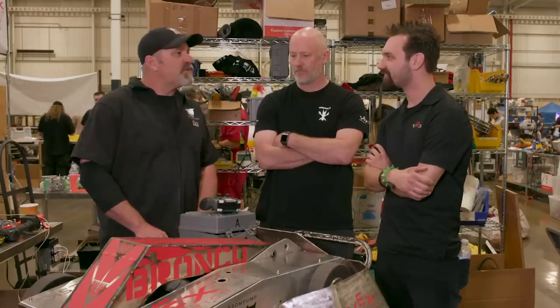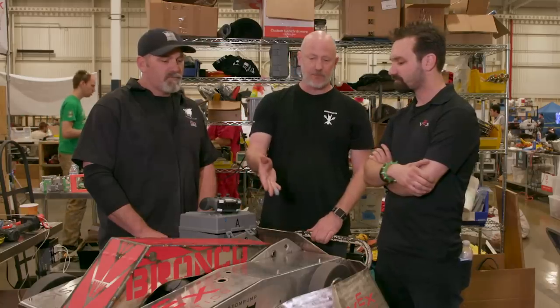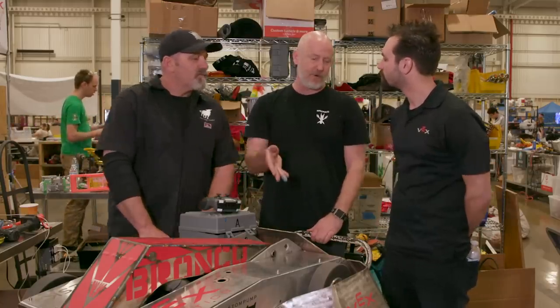There's a lot of really complicated valving and sequencing, and all the controller programming for the mixing curves. It allows us to have an incredible amount of functionality and choices we can make for how the robot drives and how it all works. We can plug a laptop in, watch how Reason's controlling it, change those curves, and actually reprogram it over the air. The design cycles of 'did that work?' become instantaneous. The speed controllers are also by Vex and they allow programmability for current limits, braking, or coasting.